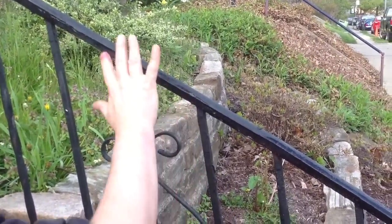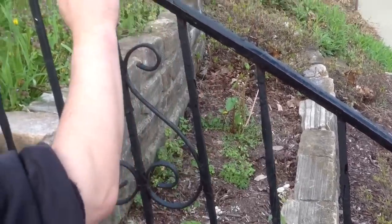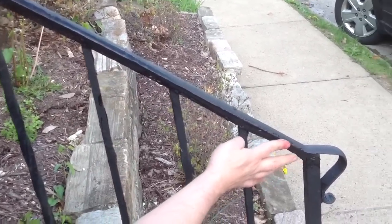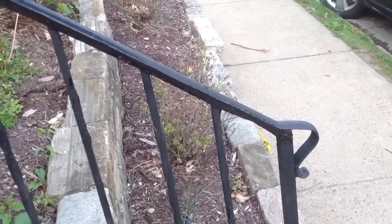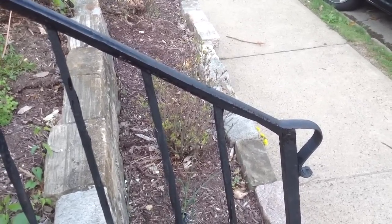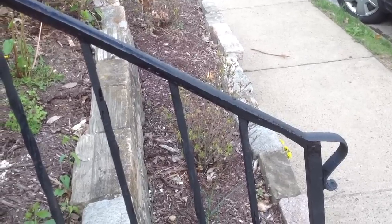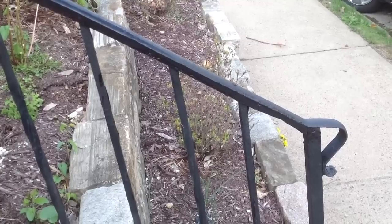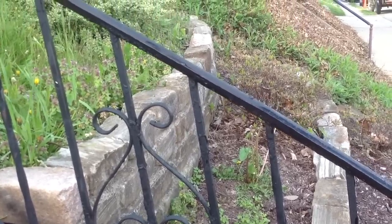It's just nice how you can form it, and you can see very little draws to your finger — just a little bit. And we filled up that big area. I'm going to go ahead and finish this up and fill in the rest of the big areas. And that's how you can use polyurethane caulking to patch metal, fix a handrail, patch your gutters — anything exterior that you need to fill in a gap or a large space where you need to form it with your finger.